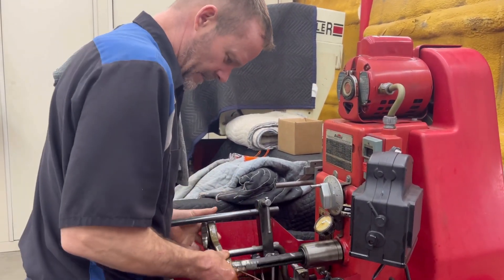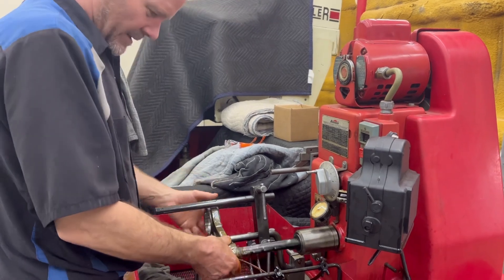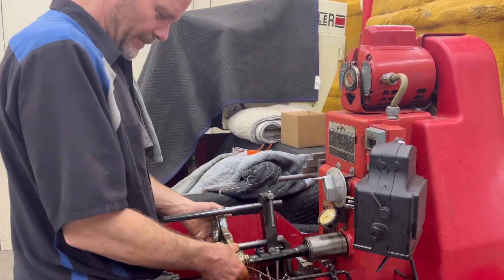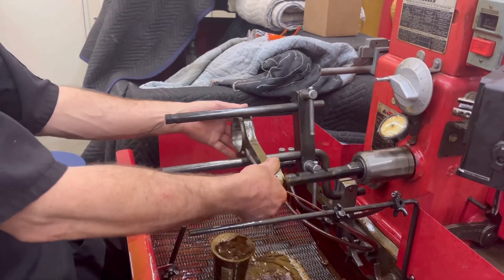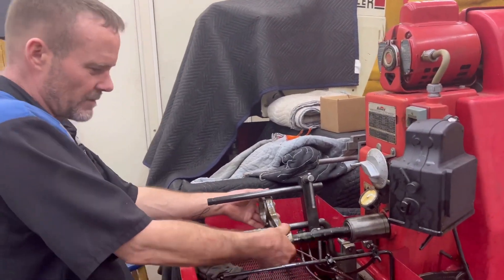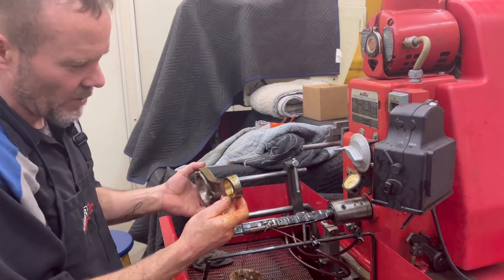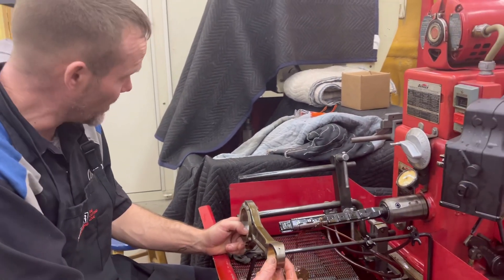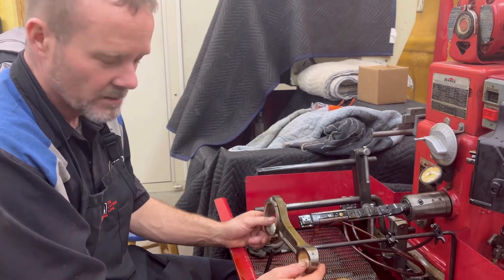Turn the spring pressure up a little bit. I can adjust it and still keep it straight — that's why I was worried, but I put one on the top too, so that helps. I'll get ready to run some hot soapy water to wash these rods when you're done. We do want to explore getting a set of rough diamonds and I'll just change the mandrel — cut them all to within a thousand or maybe two or three thousandths, because this is taking a long time. This is probably 10 to 15 minutes per rod. It's going to be easy to over-cut. We never have a problem over-cutting on the hone for the cylinders, and hopefully I never over-hone another rod.